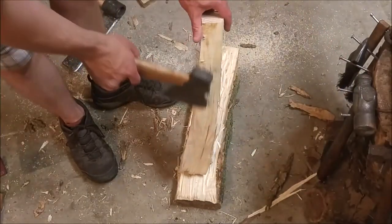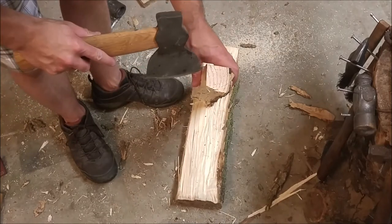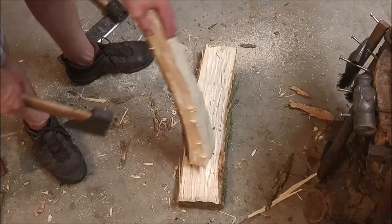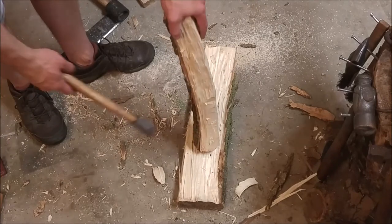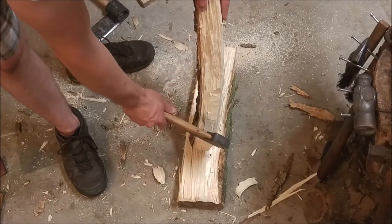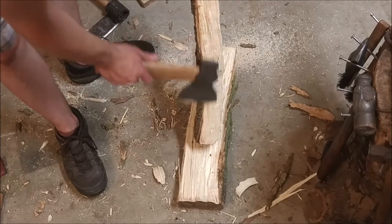I'm going to take this material down in a safer way fairly quickly — remove some of the excess and the bark. Just keep in mind you do want to keep this oversized; you don't want to take it down too close. When you're doing any of this type of work, typically you score and then remove. Part of the reason for scoring is to act as a stopping point — that cross cut across the grain will prevent the splitting from continuing in a direction you don't plan on. As you can see, it's a very good result as far as green woodworking goes.